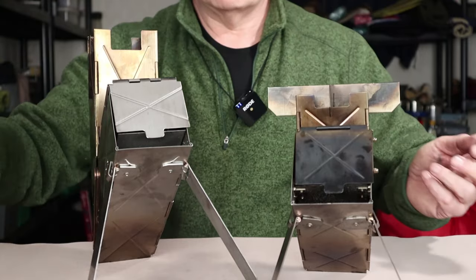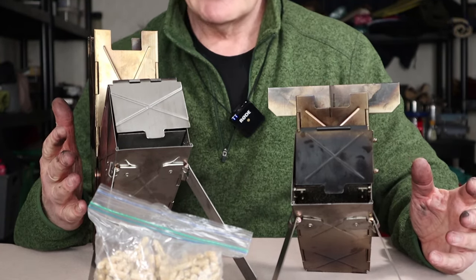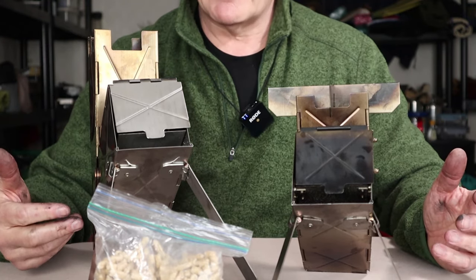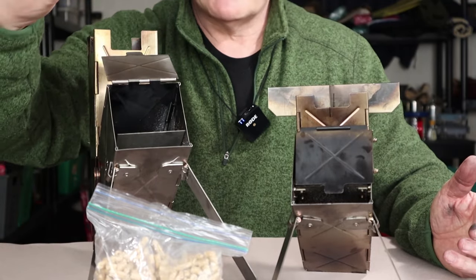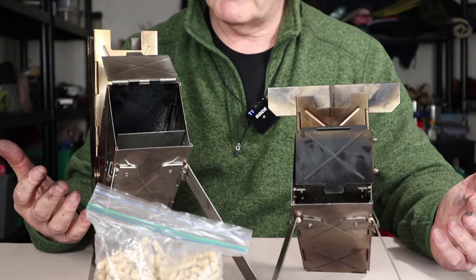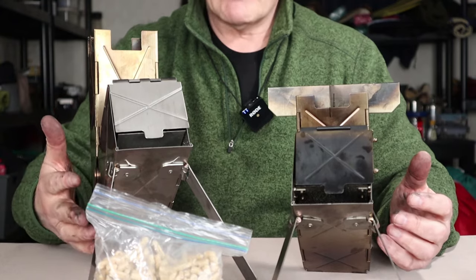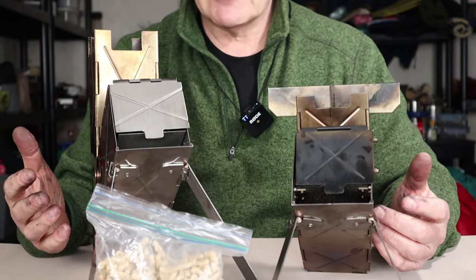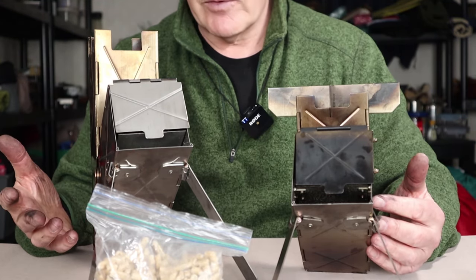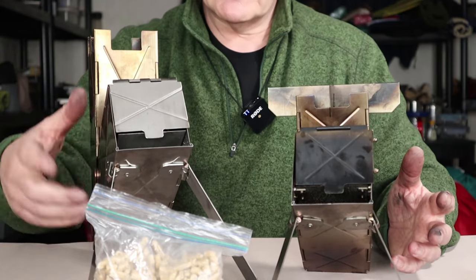I tried wood pellets in the larger stove and it's surprisingly effective. The flames will easily reach out of the top of the chimney. The fire grate is just about the right size for pellets. If I pour the fuel in through the feed port, they all rush down to the base, cover over the fire grate, and maybe one or two pellets drop through but nothing that prevents the stove from being used. Then all I need to do is ignite them from the top like you would any other pellet stove, and it doesn't take long before the air rushing through the pellets really has them engaged. This stove will go through pellets faster than a lot of stoves and produce a lot of heat.